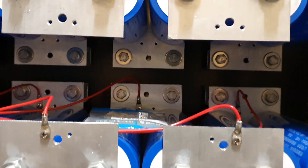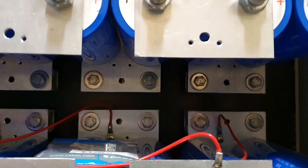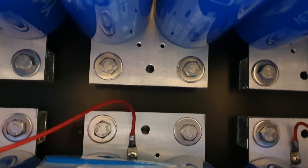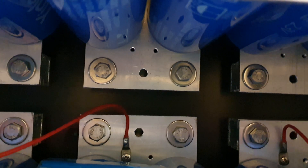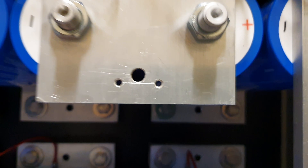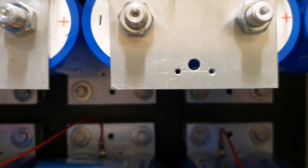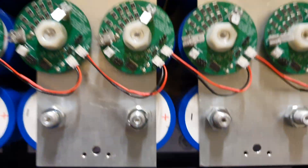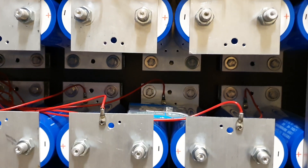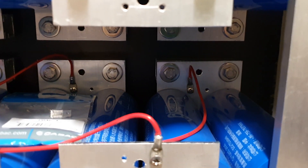What I've also done when I built the BMS in the first place are the actual bus bars. If you see the back, there's two 4mm holes and also an 8mm hole — those 4mm holes are actually drilled and tapped. Same as the front ones, they're actually drilled and tapped, so I'll be able to put 4mm lugs on each one of those for each individual BMS board. That makes it nice and neat — I was fortunate that I did that in the early stage. You cannot have too many nuts and bolts and fittings to go on your bus bar.